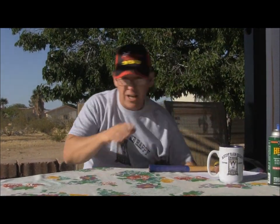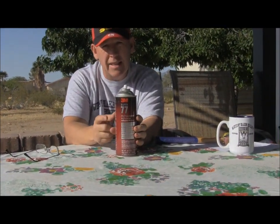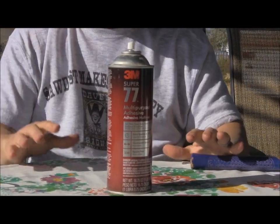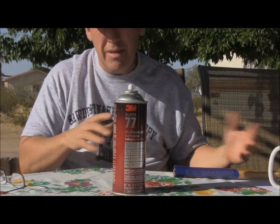Okay, so here's something to think about, Jim, and I used to do that too, is actually sand the paper and glue off, and it tends to gum up the belts pretty bad. So what I do now is, and I didn't bring an example, but first of all, what adhesive? This is the adhesive, and I got this recommendation from some other guys. I don't use a lot of glued paper on the board and then carve through the paper. That's a great way to do it. I don't need to do that too much because I just cut my layout letters on my laser and spray them, so I don't have that. But sometimes I do for artwork and all that. But this is the adhesive that seems to work really well.